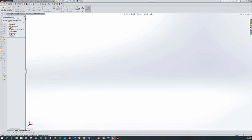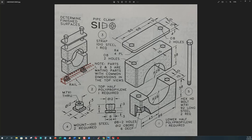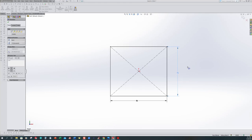Make sure your Features tab is selected, so Extruded Boss/Base. I'm going to select the front plane, come up and select a center rectangle, and I want to start on my origin. Pull it up, then smart dimension. We look like we're 86 across and then 38 high times 2 — so 86, and the height was 38 times 2, which is now 76 millimeters. With this I'm fully defined and my basic shape is ready to roll. I exit my sketch.